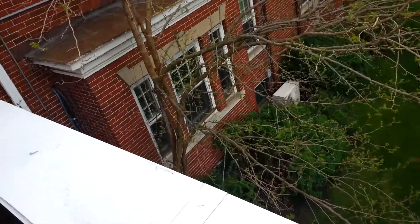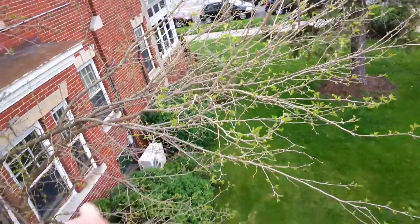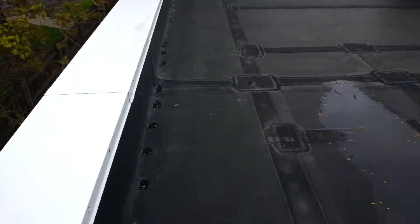We also have an option — if we get this drain tile going good, and possibly there's a drain tile over there, we may be able to come off with a lateral underground, a perforated lateral, to help grab some of this ground water if it continues. And that would be a separate option.